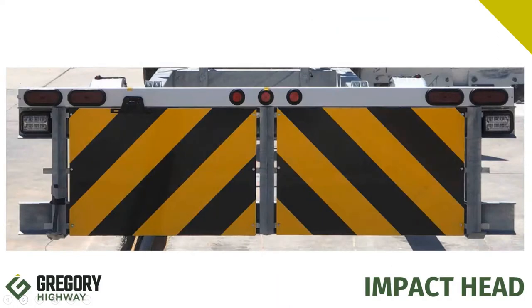The impact head is the most visible of the major components on the TTMA 200. With its increased size, it creates awareness for oncoming traffic, but also, and most importantly, it provides a safe impacting environment for capturing errant vehicles. The impact head has two 24x36-inch reflective chevron panels, which can be customized to meet the specifications of any operation.